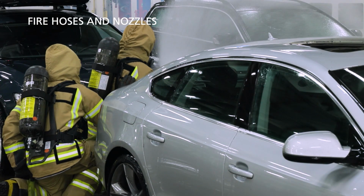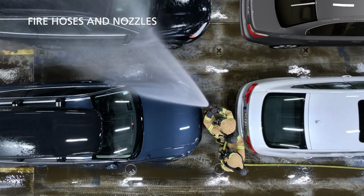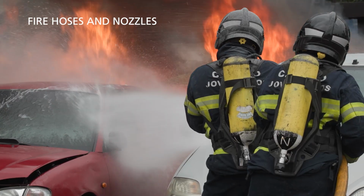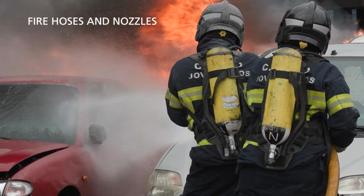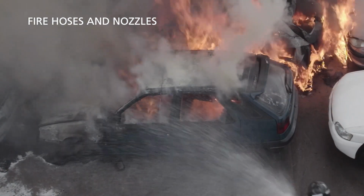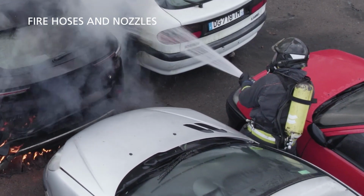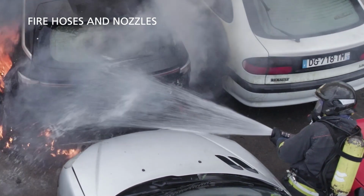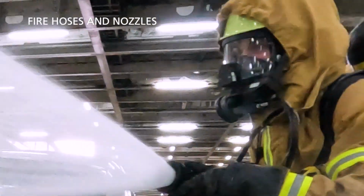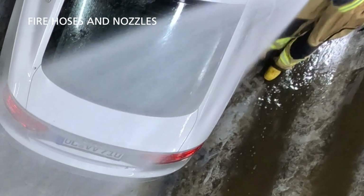Water should arrive at the vehicle caught on fire for cooling or suppression. Try to avoid a straight jet. Water droplets have a better cooling capacity. If the lithium-ion battery is violently active, protect adjacent cars. Extinguish fires in adjacent cars to prevent further spread. After that, suppress the primary car fire. Last, make an attempt to cool or suppress the battery itself if needed. Repeat as required. Continue cooling or change to a wider angle for protection during backward movement.